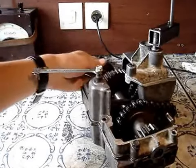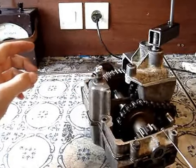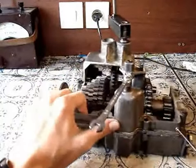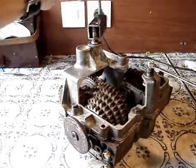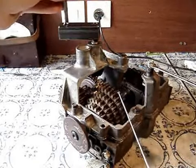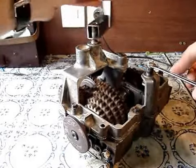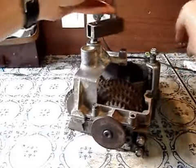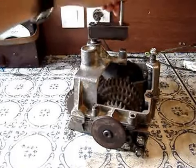There's a little hole on the shaft — this is the selector bow which slides in and out on the gears. Now in first gear, it's connected — that one gear there — to the output shaft, so now it's turning. I'll go right over to the top gear, which is now connected — that one gear there — to that drive shaft.